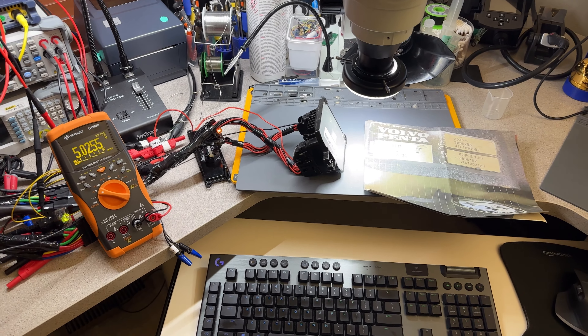Looking at that history, the only thing we have is an engine shutdown telltale set — nothing on the CKP. So I double-checked my connections and it was indeed my connection to the simulator giving that fault. I corrected that and no more fault. I was doing a check — the green channel is connected to the CKP and the yellow one I was touching the signal after the IC. They were a perfect image. I saved 20 through 23 waveform windows and we can see on the blue channel, which is injector A, that the problem is indeed happening.